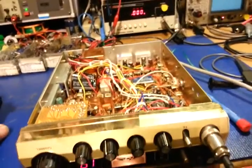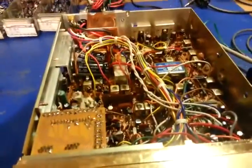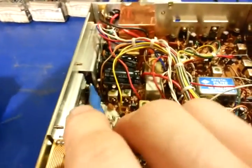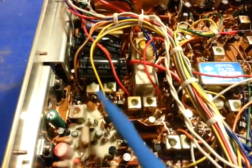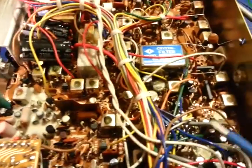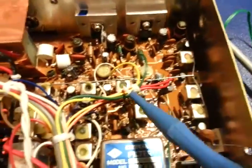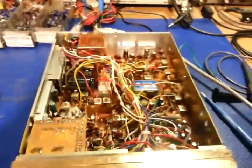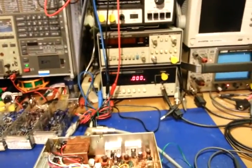One thing that's extremely rare: I have not touched basically anything other than replacing all the electrolytic capacitors. I had the heat sink out to get to the ones tucked down in there — the same ones that leaked in this one too. But look at all of the transformer tuning cores — they're all still sealed in factory wax. I reseal them when I work on them, but these are untouched, still original factory. I have not done any alignment whatsoever on this.